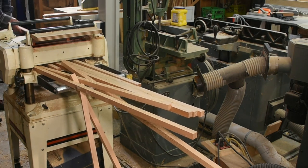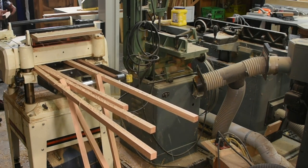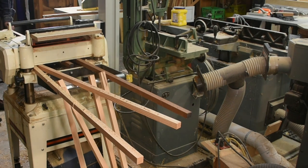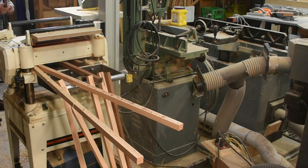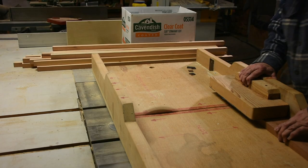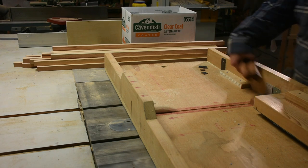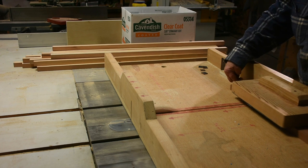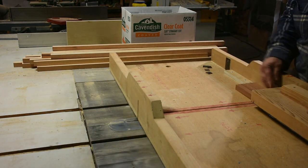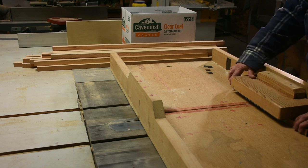Here's all the pieces. I've ended up with probably enough to do two boards, but I really want to mix up the grains. We're after pretty close to one inch by one inch — it doesn't matter if they're a little over or under as long as they're all the same size. We're gang cutting them — putting about five or six together on the sled. I use a hold-down board on top to stop them from getting caught on the blade. I put a bunch of boards together and run some painters tape over one end to hold them as we move them along the sled.